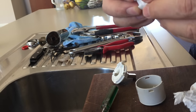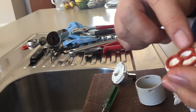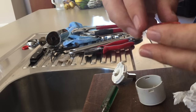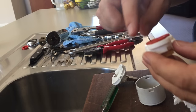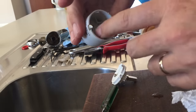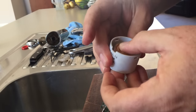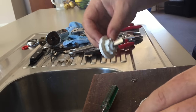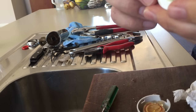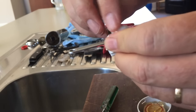That goes back onto there on that face. I'm also going to grease the O-ring there — checking it out; if there are pinches or breaks you'll know because you'll have a leak and you'll need to address that. Make sure there are no little stones or dirt in that track down there, and then set that back into place — it clicks back into place. You can put a little bit of lubricant onto the sides there as well.